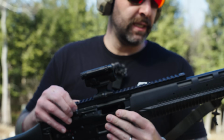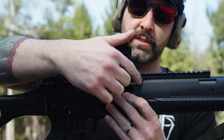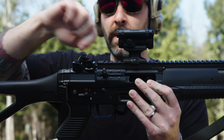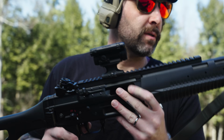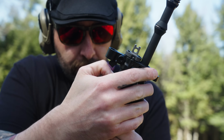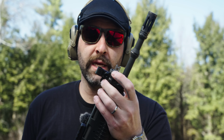I added a B&T Swiss top rail to it. So these SIGs have a dovetail, like a keystone-shaped dovetail here, and that metal bracket forks into the keystone dovetail, and then it has a set screw that plunges into the rear diopter sight, which is cool. It's got a tritium rear diopter, it's got a tritium front diopter, and you can flip this down. You can flip that down so you can have just the normal iron sight blade diopter, and then you can flip up your night sight diopter, front sight post into the front diopter.